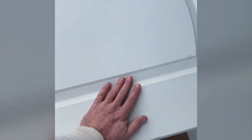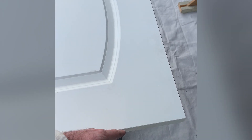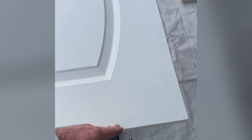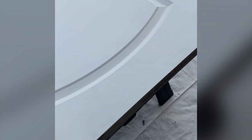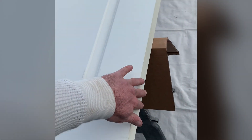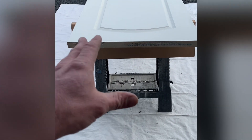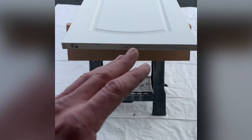Hi, Jay with Jay's Doors and Trim out of Cass Rock, Washington. Today I'm going to be pre-hanging this door. It's a 32-inch slab — it actually measures 32 and 1/16 inches. The edge isn't beveled yet. The hinge side isn't mortised and prepped yet, so I'll be doing all that work myself. I've got my 4 and 9/16ths exterior door jamb, mortise the hinges, the adjustable threshold, get the door prepped, and make my own pre-hang.